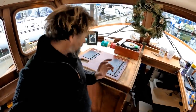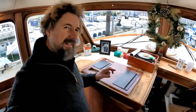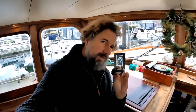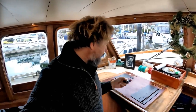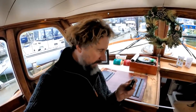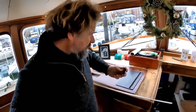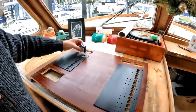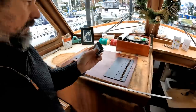we've had a couple of days of tough stuff, drilling that, cutting this. Today is no exception. Let me explain. So you use the same blue sea breakers for both the AC and the DC circuits. They're basically rated 15 amps. Circuit breakers don't care whether it's AC or DC, they're just measuring amps. So you can imagine there's going to be a whole row of these, 16 on the DC side and 10 on the AC side. And well, that's pretty straightforward.